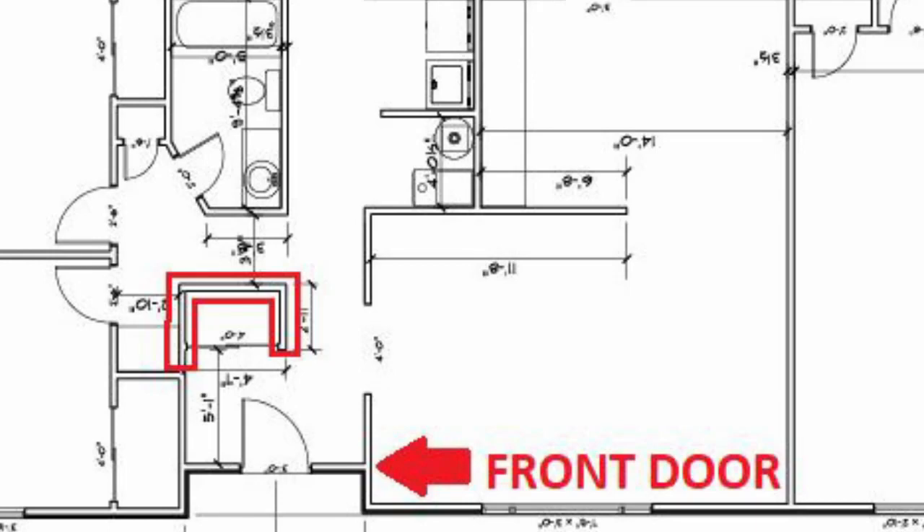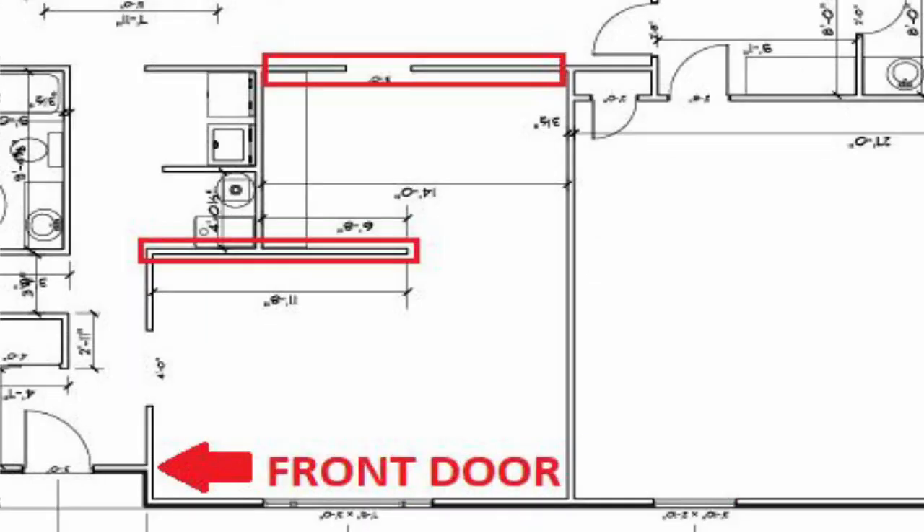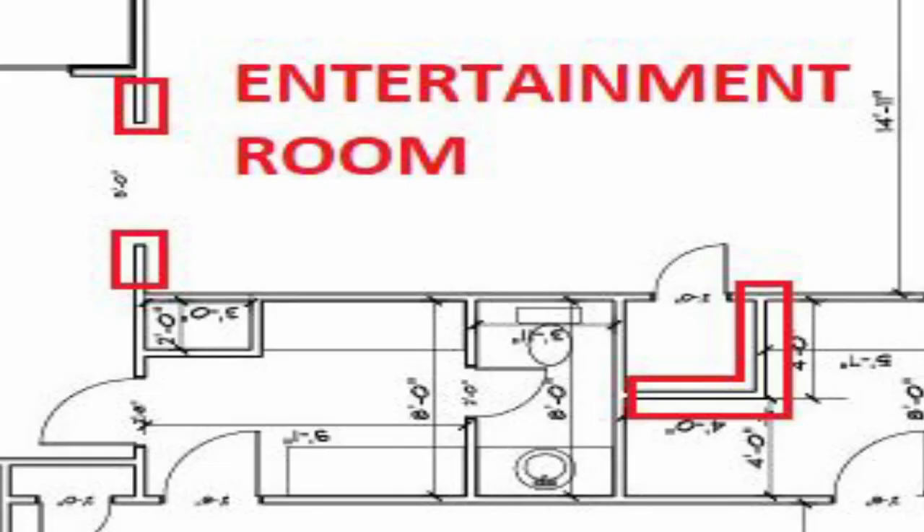Here's the floor plan of the home as-is. As you can see, it is very compartmentalized and we want to create a more modern and open floor plan. To start, we will be removing the front entry closet — none of those walls are load bearing, so we shouldn't have any problems. Then we will remove the walls in the living room, mechanical room, and laundry room — also not load bearing. Next, the walls in the living room that are load bearing will be removed, which will require that we install beams above them. The last sets of walls to be removed are in the entertainment room — the entry into the room will be widened, which will require putting a header in. Then the two walls in the closet will be removed to increase the square footage of the shop/storage off of the garage.